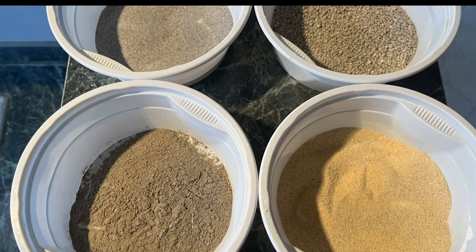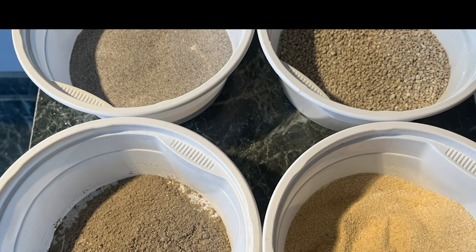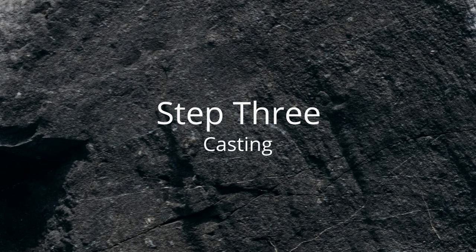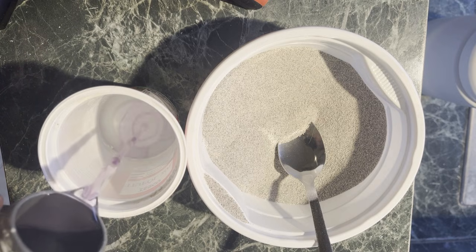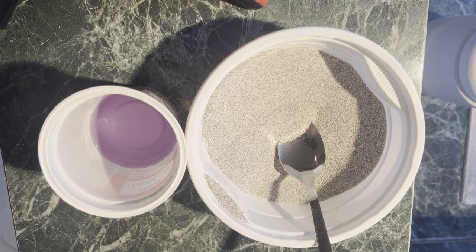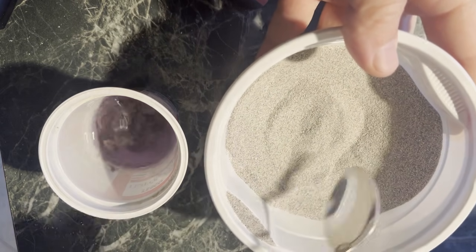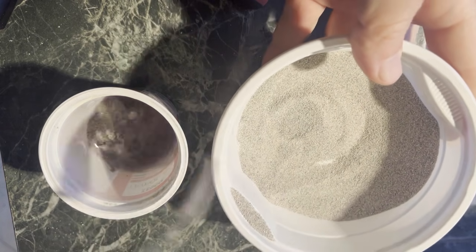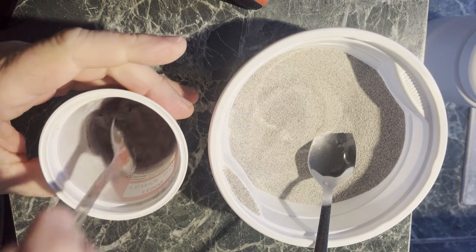So here are the 4 candidates for stone casting: silica sand, granite grit, basalt powder, and desert sand. In the next step, we're not measuring out the water glass — remember, we don't have a scale. Instead, grab your mold, which in my case is a plastic pudding cup, and pour in about 1 cm of water glass. It must be undiluted — in fact, I usually boil mine down to make it even thicker. Into this roughly 1 cm layer of water glass, I start spooning in the dry, catalyzed mix. Watch how it clumps instantly.